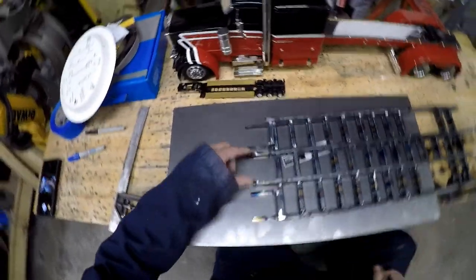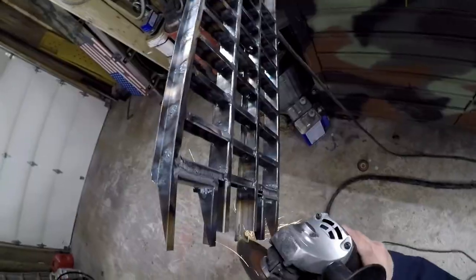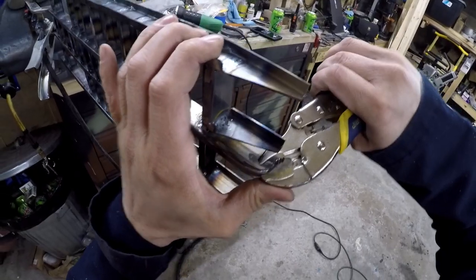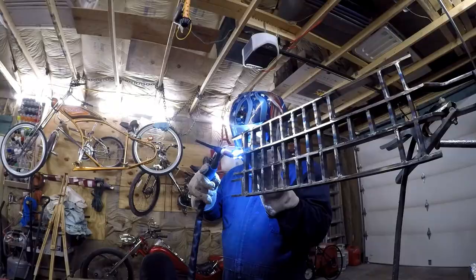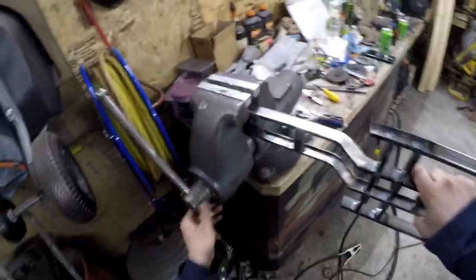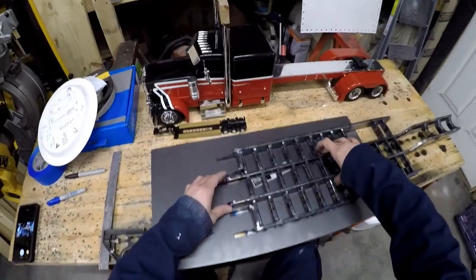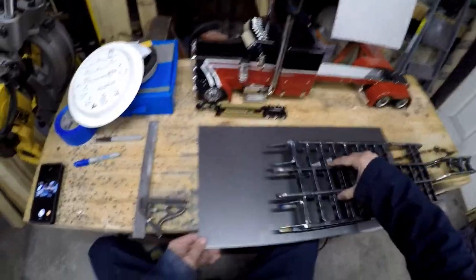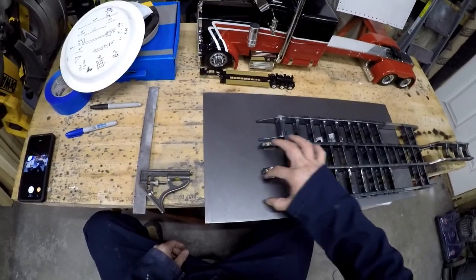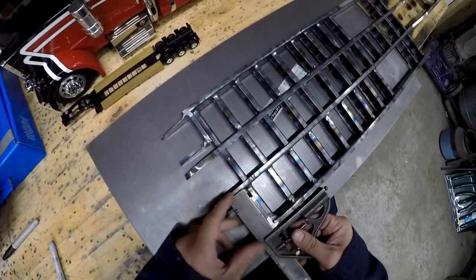It's welded straight to this all the way down, and that's on both sides. Once I got that done I was able to flip the angle, bend the top down, weld it back together — had to add about a quarter of an inch to each one. Then it was lunch time. The next step now is more cutting; now that I have these on I'm going to make the skins for them.